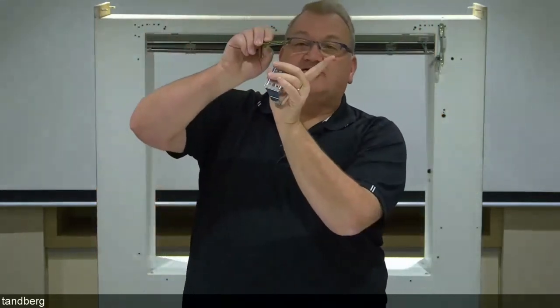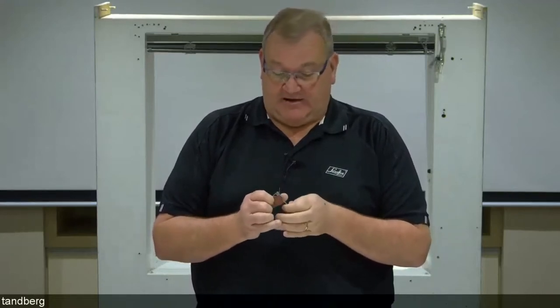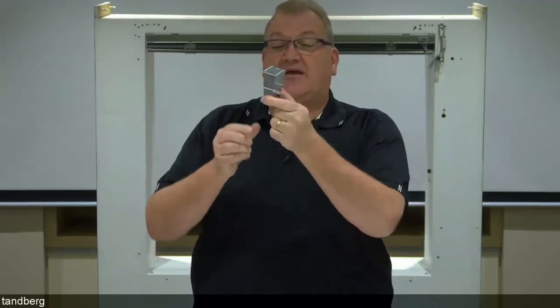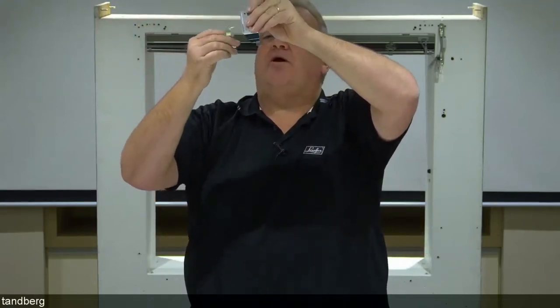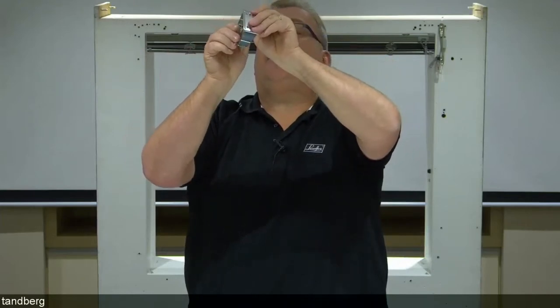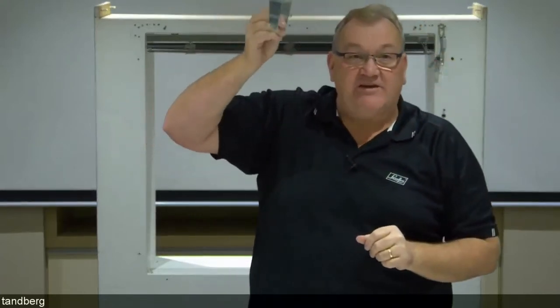If you're not able to clip that Venetian on from the front perspective, because you do need with these products to lift it on from the front, sometimes you may have a bulkhead, or you may have an area where you just don't have the ability to use the standard bracket. You can call up a reveal fit bracket. Now the reveal fit bracket enables that to be fitted up inside, okay? Head rail comes up and sits in there, and then we come along with the bottom and we clip that on, and that holds the blind in position. So that's what we call a reveal bracket, okay?